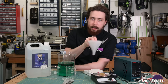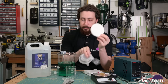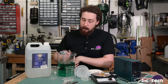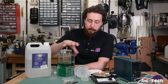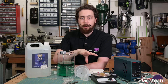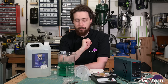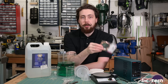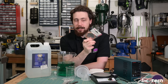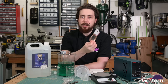Optional things: some funnels. These help a lot because you might want to filter your solution. Using those thin anodes gave me little bits floating around inside the solution, so I just filter them out. You don't want any bits floating around when doing the actual plating because they can attach to the surface and ruin your finish. You'll also want some copper wire to hang your parts from in the solution - any wire will do but copper is easy to get.